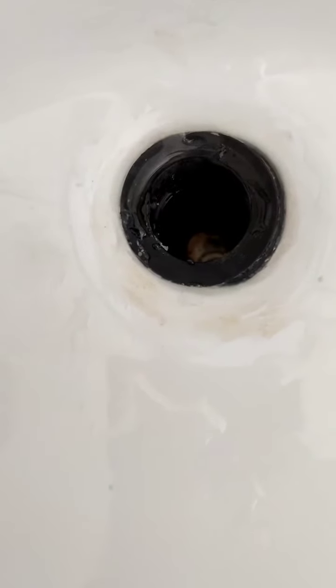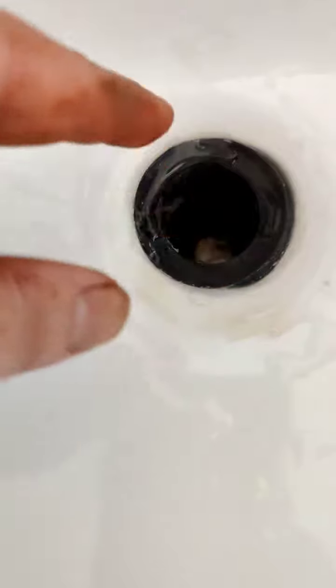See how there's this edge piece here sticking out around the edge? That should be perfectly circled, perfectly aligned with the drain — you shouldn't see a side piece sticking out. Because that squished out, silicone was put in there, and all that did is yellow up around the drain. That's going to continue to look bad, worse and worse, and it's not the correct way to install it. It should be either with plumber's putty or that little black ring.